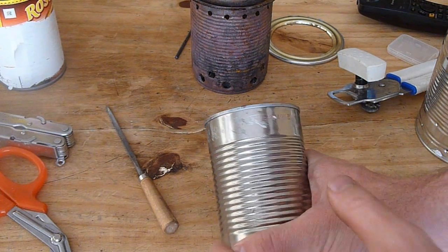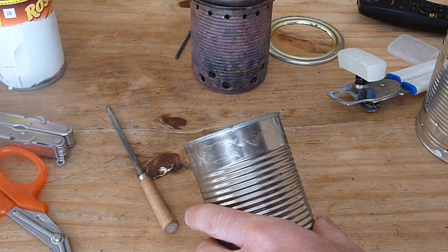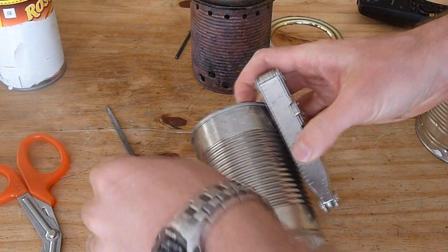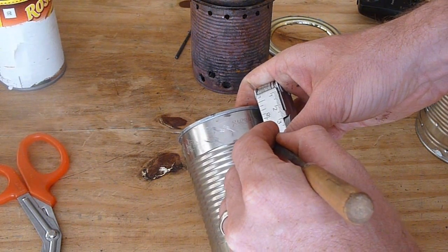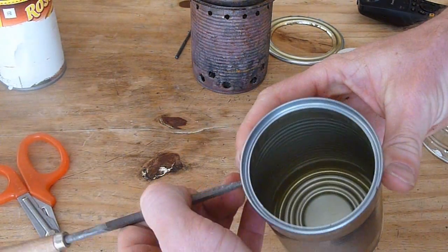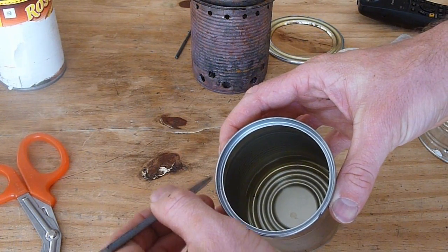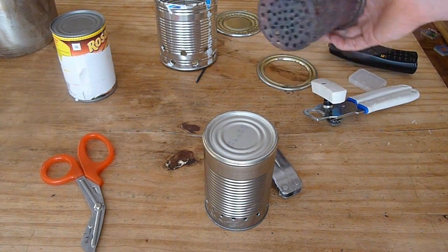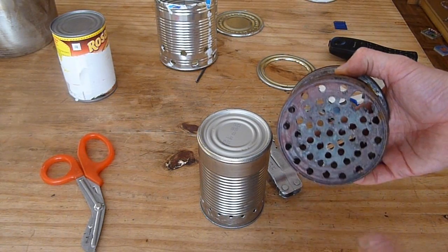Before doing all the drilling, I'm also going to mark my holes in the inner can — the 3 inch diameter can. All your holes work around in a circle; you're going to want about 16 holes, and they're going to be 3 and 1/4 inches down from the top, evenly spaced. I find it easiest to start by working on the four extreme sides, then mark the holes halfway between each of those — that gives you 8 — and then halfway between those again gives you 16. Finally, you'll want to drill the holes in the bottom of the inner can, making a concentric ring all the way around the outside and working your way in, and this is going to allow lots of airflow to come in the bottom.